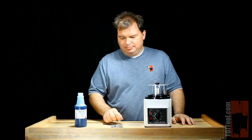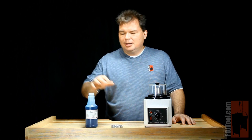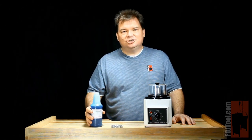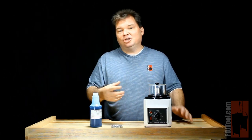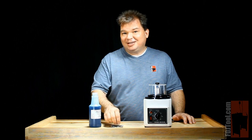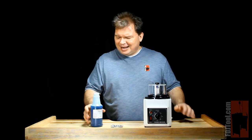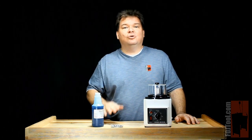But when you use these magnetic steel pins for your tumbling, you're going to need to use burnishing solution in the water. Please don't use those crazy chemicals and solutions that other people have told you to put in their tumblers. Use the right solution for the right job. Burnishing solution is inexpensive. It's not just a soap. It does take away all the dirt and debris that accumulate in the solution during the tumbling process, but it also helps to condition your steel shot to keep it nice and make it last longer. It's also going to act as sort of a lubricant. What it does is help things move around in the solution so that you get better results. And you only use a couple of drops at a time in a tumbler this size. So use the right solution for the right job and you're going to get very good results.